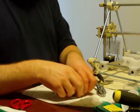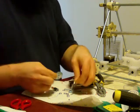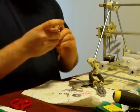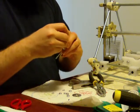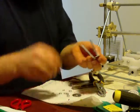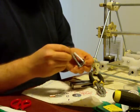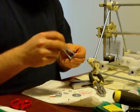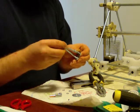You've got this part right here, and you have two washers that I include that are drilled on either side and in the middle. You can take whichever one you want and put it at the bottom. Then you put these two 5/16ths in like that. Then you use two of the tiny washers that are included. You must use washers on this. This part heat cycles, and you'll have things get loose if you don't have these fastener washers.